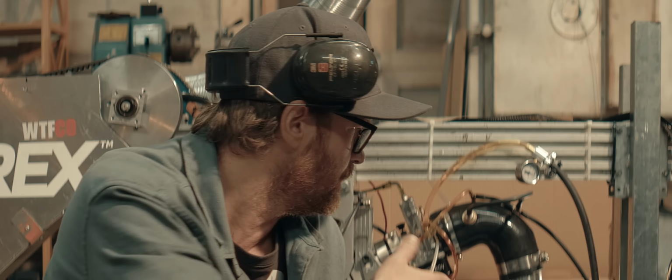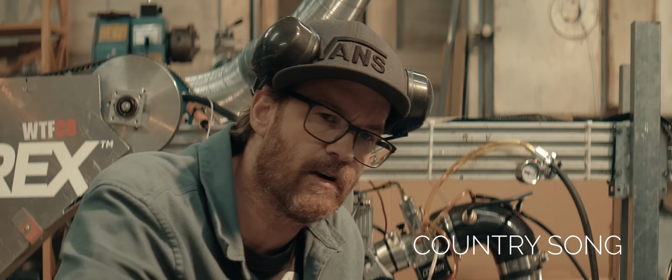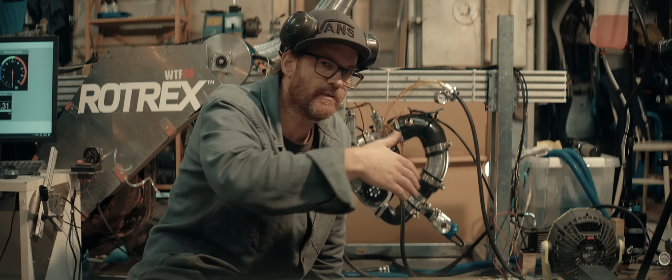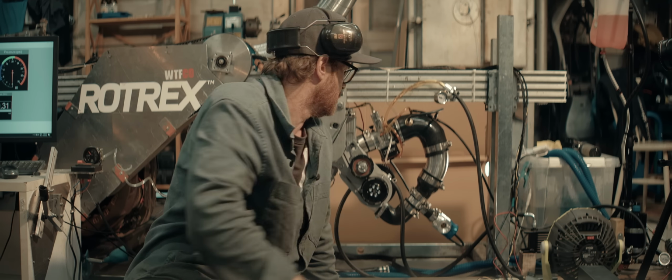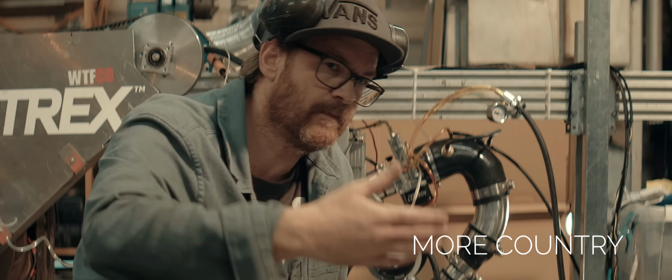We're having some problems with inconsistency here. It sometimes wants to go, sometimes not. Sometimes wants to start, sometimes wants to stall. I think it's due to the low velocity at this low RPM. And fuel is puddling around in the crankcase, suddenly mixing with the air, sometimes not at all.